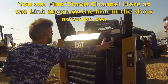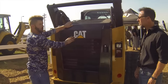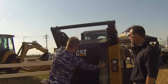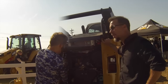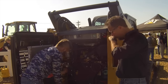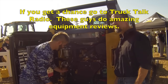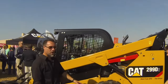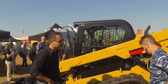I also like that it locks. I'm big into security — no one can tamper with my machine on a job site when I leave it. You open it up. One thing I will say is you do have your camera here, because the visibility out the back window is just not there. The camera's a good cop-out for it. But the fuel filter here is super easy to service — we can drain it into a Dixie cup, then spin it out. There's going to be some diesel that leaks and dust is going to stick to it and get grimy, but it's somewhat out of the way.